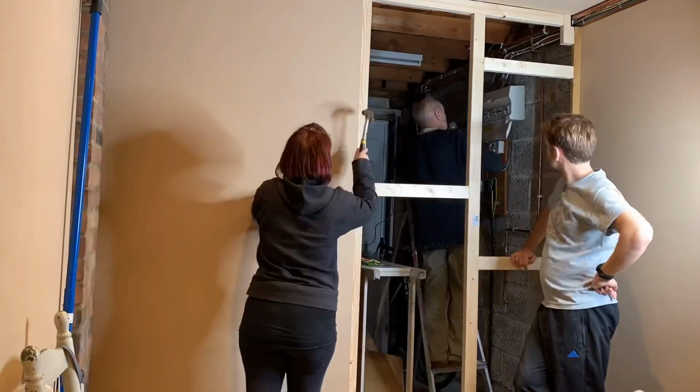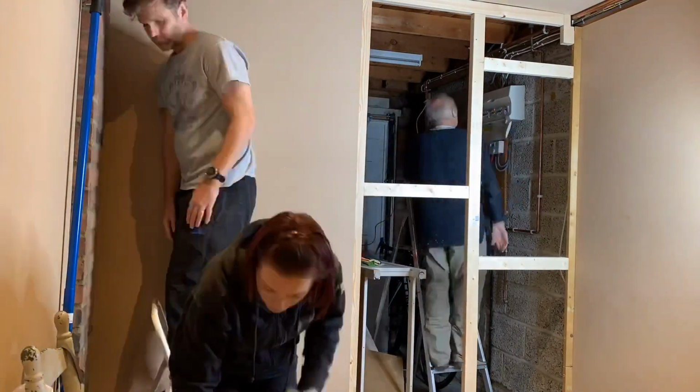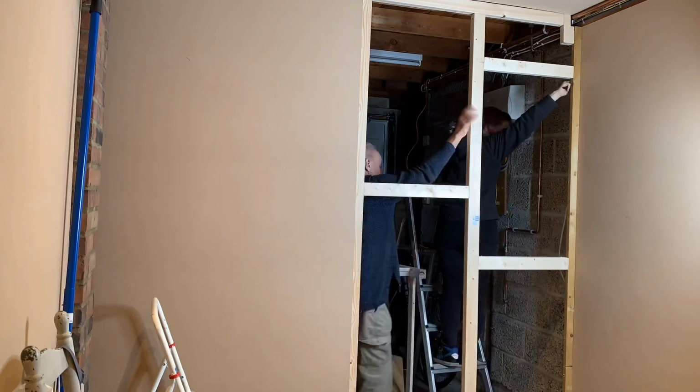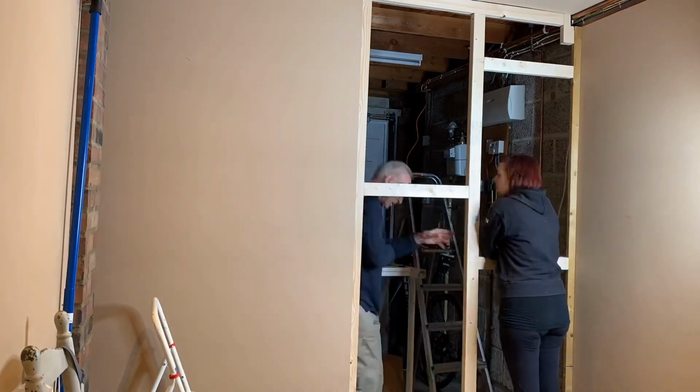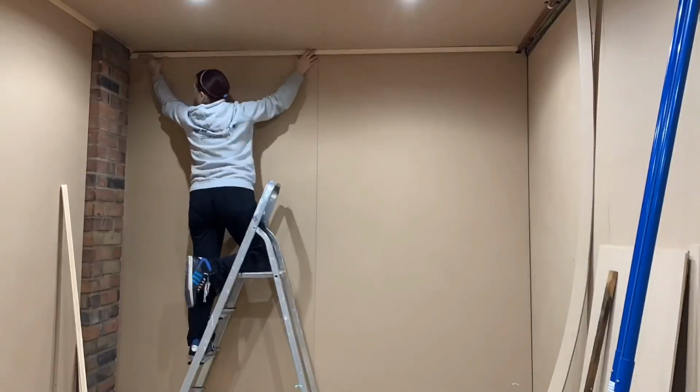We filled between the rafters with insulation, just like we had on the walls, and held it in place with tape. Then we measured and cut the MDF boards to go around any pipes, etc., and we used acroprops to hold the boards in place for nailing. This was an absolute must, as those boards are heavy.